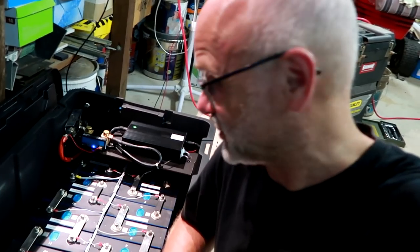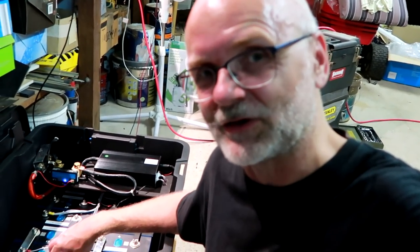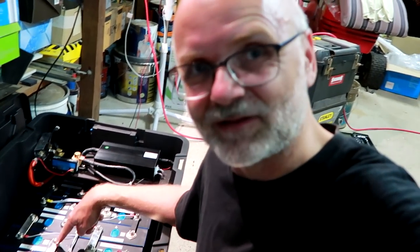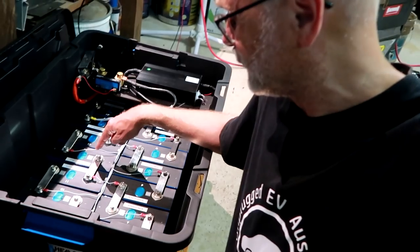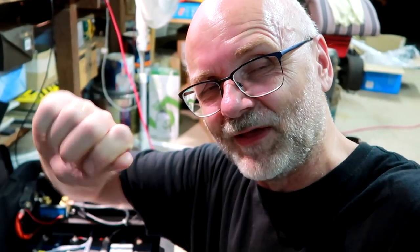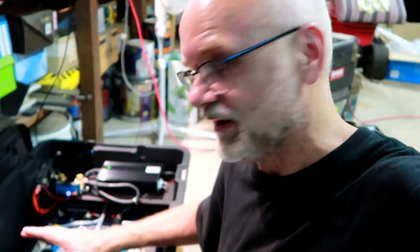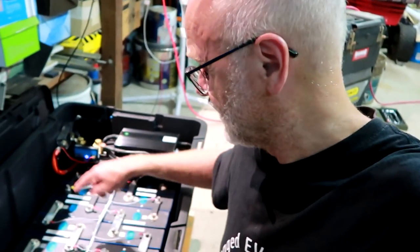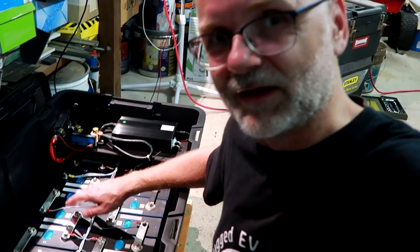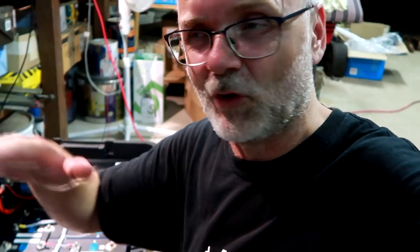I've got some issues with the battery actually. Sometimes when the battery charges or discharges and I have a low voltage cell or a high voltage cell, I have to tighten these bolts or screws just a tiny bit. You have to loosen it a little bit and then tighten it again and the voltage drop goes away. And everything is fine afterwards. It's not the cell, it's just the connection on the bus bar. Unfortunately, I have to take apart the whole battery again, clean up the terminals on the top, clean the bus bars from the underside, and smooth this all out.